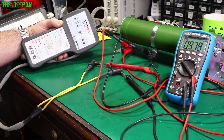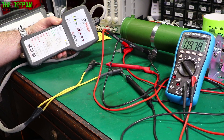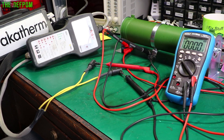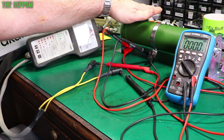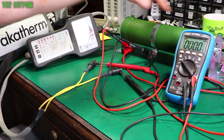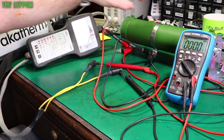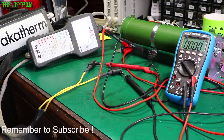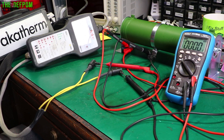Getting 98 volts — as expected. So it's welding fine. Turn it off. So that's doing the job. Voltage is gone. So that's nice and warm — I'm not going to touch it because it's going to get hot. This is a big variable resistor, I think it's 50 ohms. So I can put this anywhere along this range I want in that resistance. 98 volts across 20 ohms gives us 500 watts. Excellent — that's working properly. That's exactly what it should be doing. So this is another repaired unit.